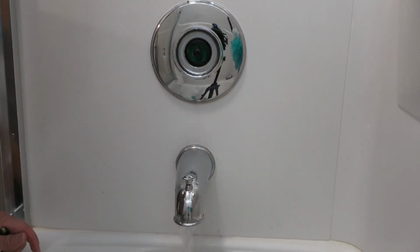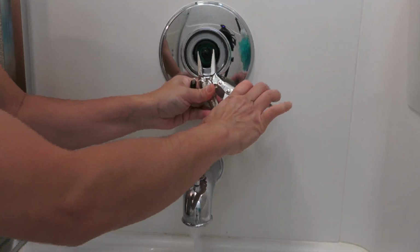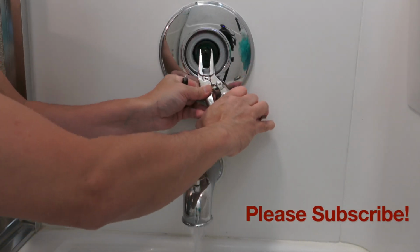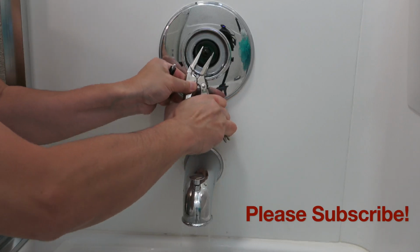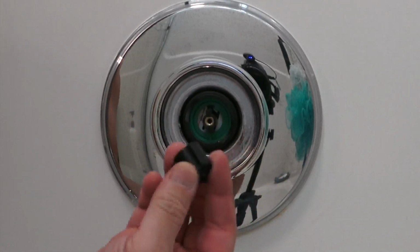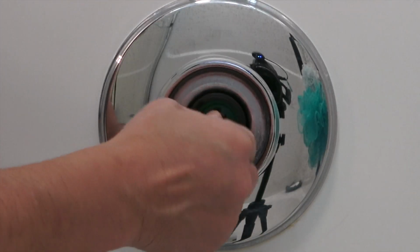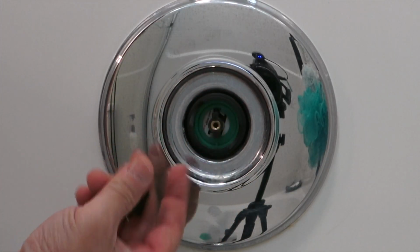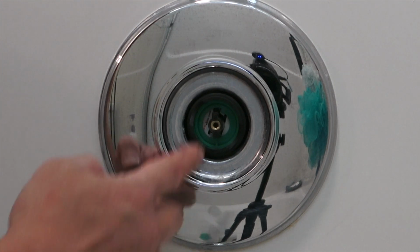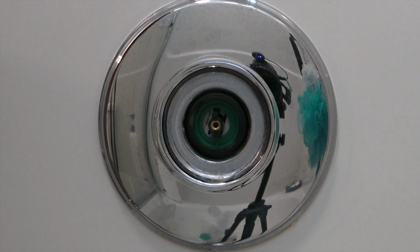All right, so the water's still coming on, as you can see. And you want to shut it off. Shut it off, like so. So now it's off, and then you can take this out because there's no use anymore. So that's a trick to turn it off, because once you break this piece here, then you'll be in trouble. You're going to have to replace the whole cartridge, and that could become really costly.